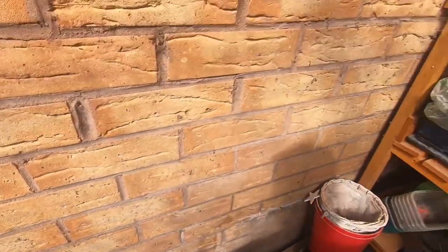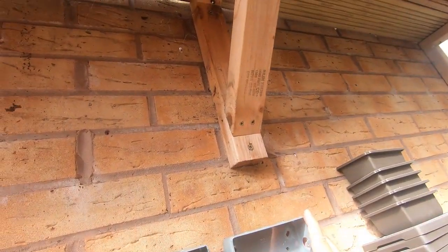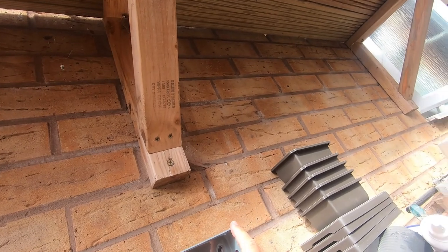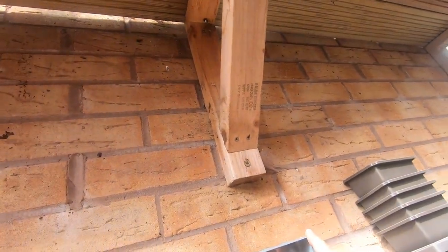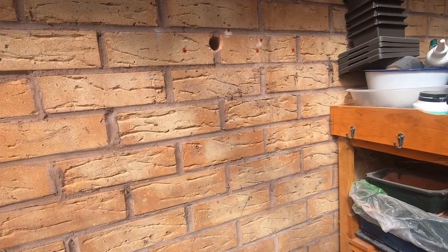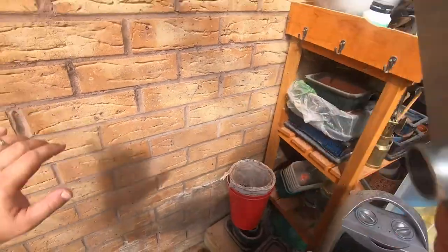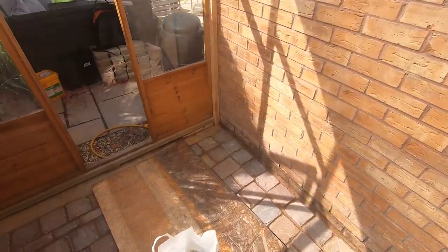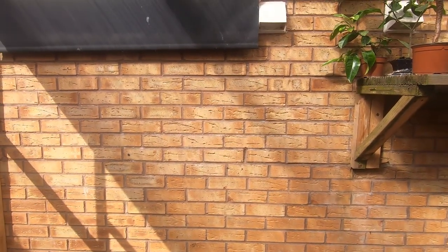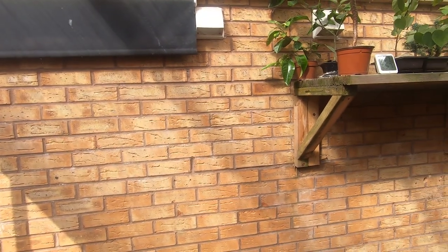We'll just line up our sockets, back boxes. Yep, we can see lots of screw holes there to capture. So we need a bush and a coupler on this end, and a little bit of conduit to disappear into the wall in there. So let's get that done. So that gives us the first two sockets, the cable in and out, the cable that way and the cable that way.